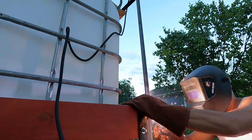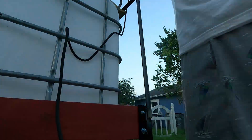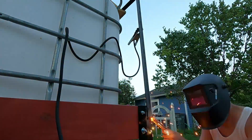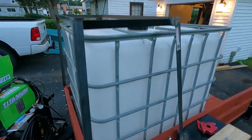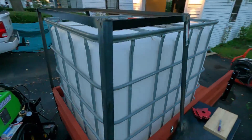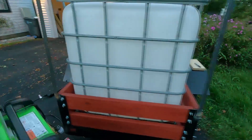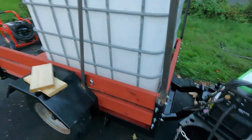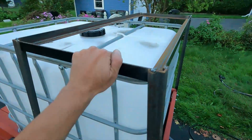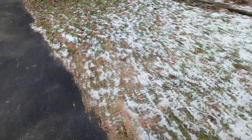Creating that frame was just one small step — now I had to mount it above the water tote. I got more one-inch angle iron and created some vertical risers to elevate the panel. This is what the finished solar panel stand looks like. I mounted it into all the key sections of the trailer for rigidity — absolutely no flex. If I move this, the entire trailer moves, which is perfect. And that's where we left off for the season.